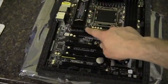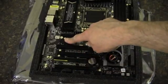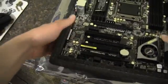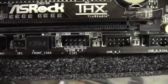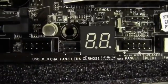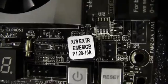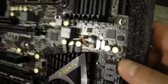We've got a molex power here for PCI express. Then we have two, three PCI express sixteen slots, one, one, one PCI express one, and two PCI slots. Coming along down here we've got HD audio, COM, IR, front 1394, USB, USB, USB, and then another fan header, the digital readout, then the front panel connectors — we've got a power and a reset button, another fan header — one is four-pin — and then we have SATA ports: two, four, six, eight total SATA ports.